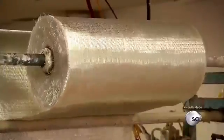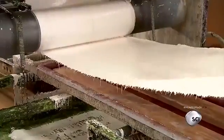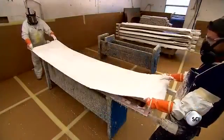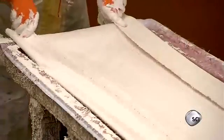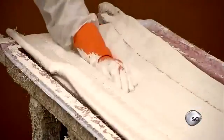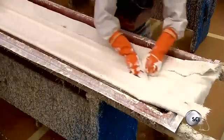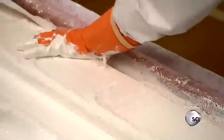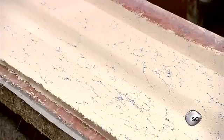The clamps come off and workers cover the cores with an even thicker fiberglass mat impregnated with resin — this is the bottom of the diving board. They make sure the mat is centered, then manually form it into the shape of the board, pushing out air pockets as they go. They spray on some decorative paint, then put the board in an oven for 24 hours to cure.